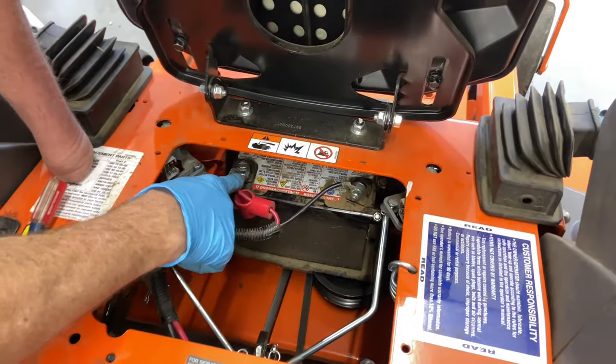Don't lose your hardware like I just did — got the hardware here. This battery is dated April of 21, and it's only April of 23, so this is only two years old. It's showing 230 cold-cranking amps — that is not a very healthy battery as far as amps go. This is a twin-cylinder Kawasaki engine, so I would definitely recommend a higher cranking amp battery. They sell you less-expensive batteries to keep the cost down on the machine, so don't expect these to last a whole lot.